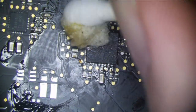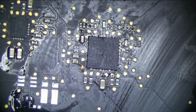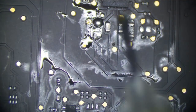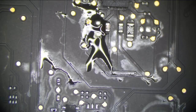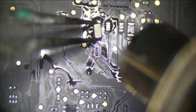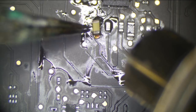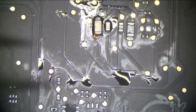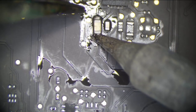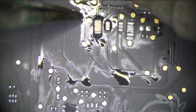This is gonna get ultrasonic'd again. Yeah, this board was an overall mess. Anything else important that we need? Yeah, I better put this cap back. I don't want to cause U7600 to melt down and kill our CPU. Good enough.